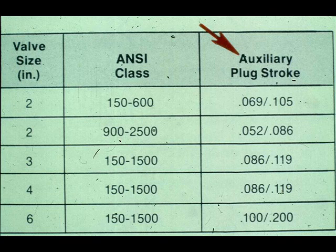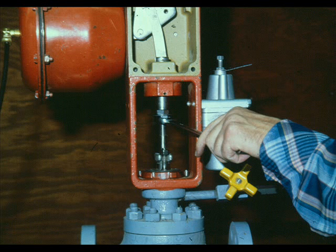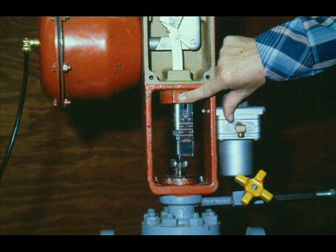This series is a tight shut-off balanced cage valve. Screw the plug stem into the actuator stem until the indicator disc and lock nuts contact the actuator stem and tighten. Apply sufficient air to the actuator to fully stroke the valve and check the actual stroke. If the stroke is not correct, make further adjustments between the plug stem and actuator stem.